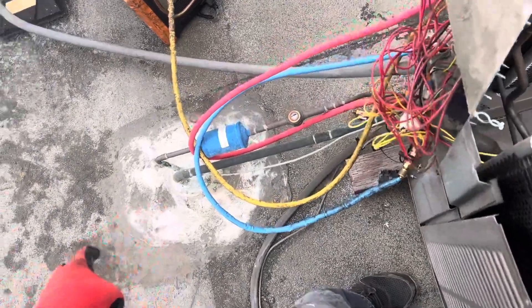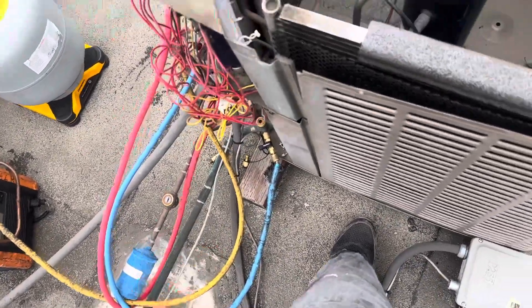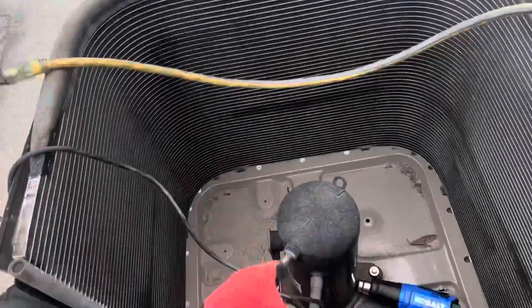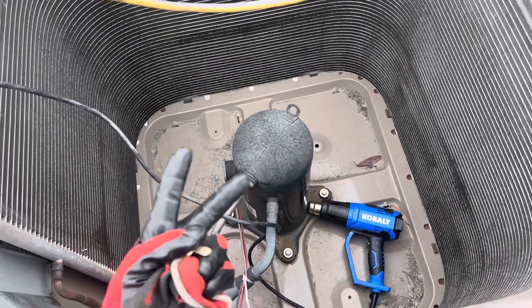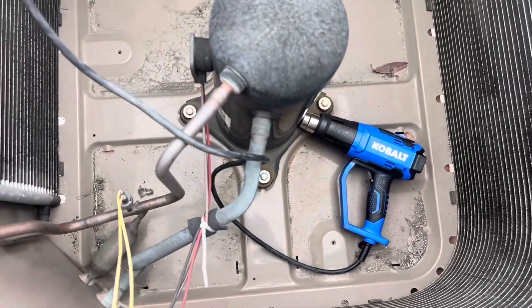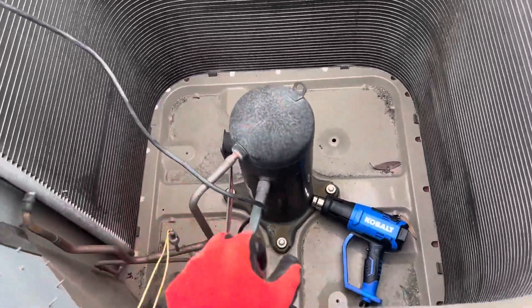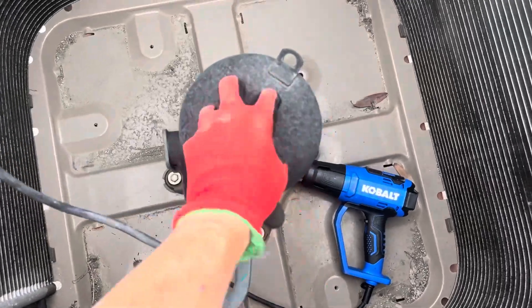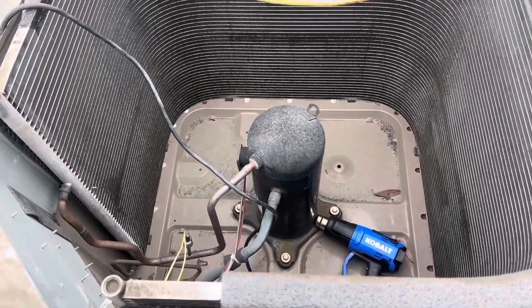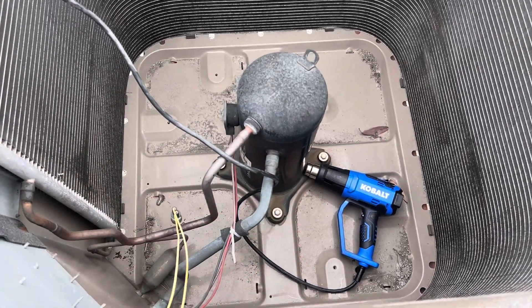In this situation the air handler is located two stories down, with 80 or 90 feet of line set. If I throw on a brand new unit, we could have almost double the amount of refrigerant oil in the system — that's no bueno. We're going to take care of that. If I have time, I'll cut off the top and show you the inside of what the scroll looks like — I think I released a video last week of what it sounded like.